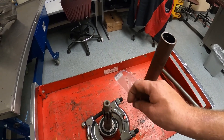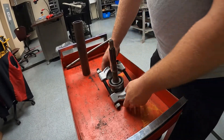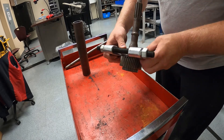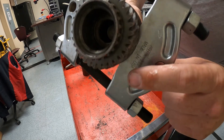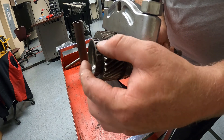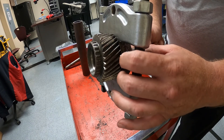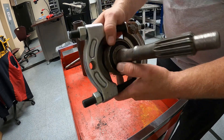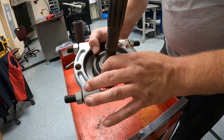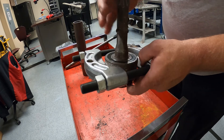Let me get this bearing splitter tightened up against the shaft and then we'll set our deck. What we're going for is the blade portion of either end to be in between the bearing and this gear - the gear is fixed to the shaft, it's all one piece. So we're trying to go in between that to separate the bearing. Ideally we want to be pressing off of the inner race, but we don't have that option here since the roller bearings cover over into the outer race.